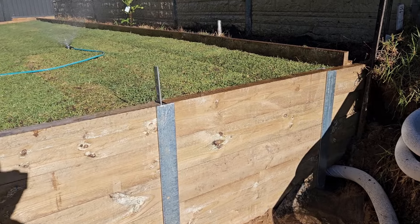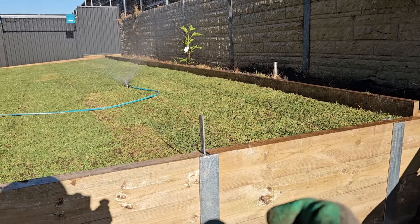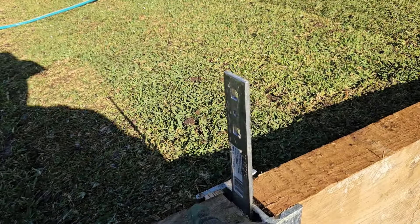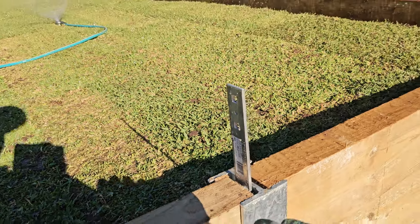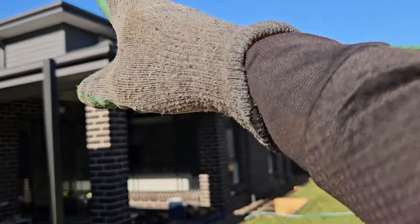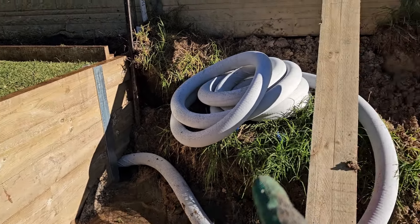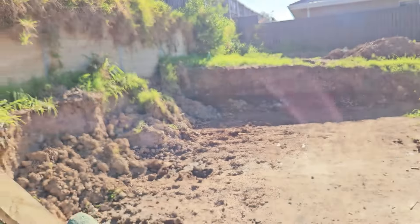The wall is completed. We install the bracket in the middle with bolts on the side, then sit all the sleepers on top of it. We fix the corner at the back of the sleeper — this is a 100mm post and this is 75mm — we fix to the side. Then the fence will be installed on top of the retaining wall, stepping up and going straight to the wall. This drain is for this retaining wall, and we connect to the other pipe on the other side as well.